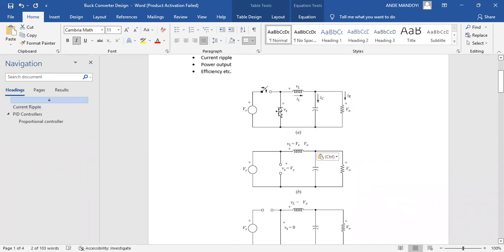When the switch is closed, essentially, well, not all the time when the switch is closed, you'll find that out in a bit. The capacitor charges, and after a bit of time, this capacitor will start discharging through the load. So it'll essentially keep the load at the same voltage as the capacitor, because you can see these two are in parallel. So if the capacitor had charged to, say, the supply voltage, 12 volts or whatever, and then as the inductor discharges, the voltage across this load will want to drop, it'll want to decrease because you're getting less and less current flowing through it.